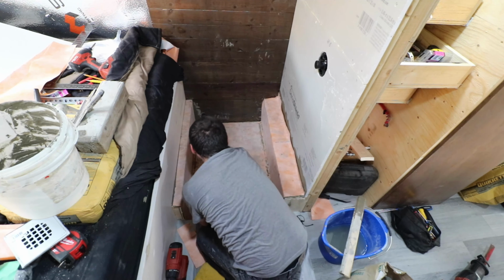So the process of how I did this to get it right, I used my wooden trowel here. This is the one I should have been using when I screeded the concrete. So I took the wooden trowel and I smashed it down into place. Then I took my 6-inch knife that I have cleaned somewhere. There it is. Then I took my 6-inch knife and I just started scraping like this, so this way I could get all the air bubbles out between the Ditra and the concrete. Like I'd make the mortar get into the Ditra better. So that's what that was.